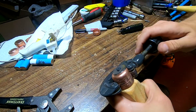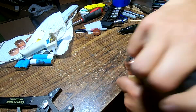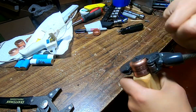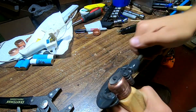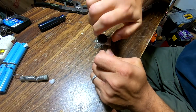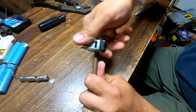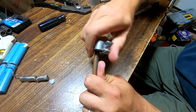The biggest challenge in cutting pipe caps with the tubing cutter is keeping the cut straight. If I were going to make a bunch of these, I'd build a jig to align the cutter. Since I'm only doing a few, I just toughed it out. The pipe I'm using for the inner section is quarter inch water line for a dishwasher. It's a little loose, but it works adequately well and I've already got it. It cuts easily with the tubing cutter.